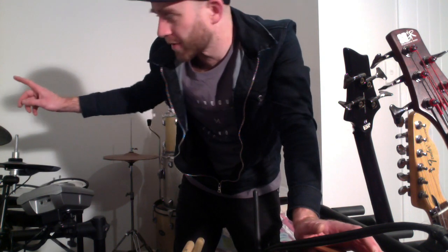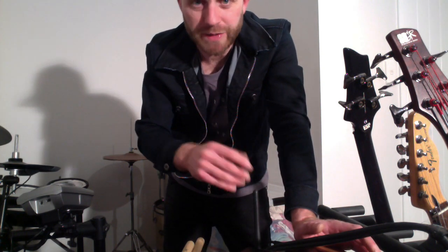I'm not going to be able to hear it, but I'm just going to randomly hit a crash cymbal on this electric drum kit, which I have cranked the gain up on, just so it's going to set the limiter off, so you'll hear how quickly it goes off, how quickly it comes back. Cool. So that's what the problem was with the old one. Long release on the limiter. That was the only thing that was wrong with it. And this is the fix. So let's have a listen.